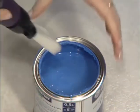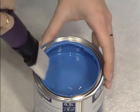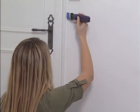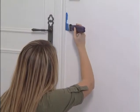When first using the Wypik, don't overload it with paint — you'll soon get a feel for applying the right amount. Turn on the vibrating brush. Position the brush head completely flat, parallel to the surface to be painted, a few centimeters away from it.